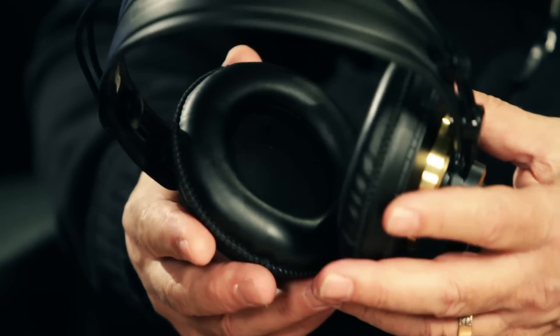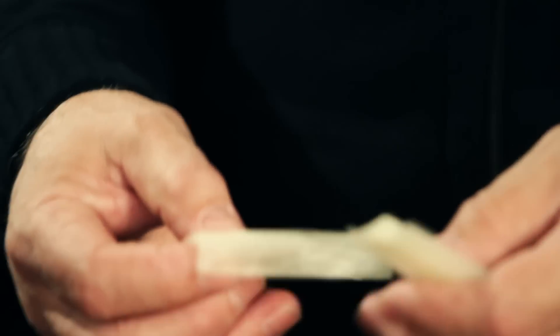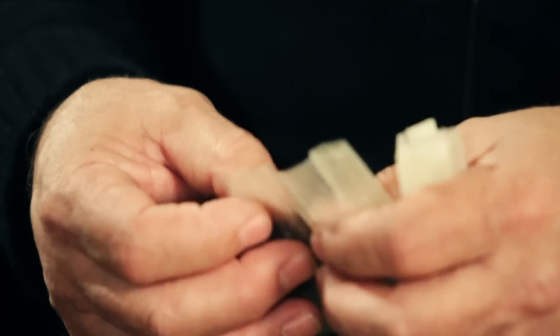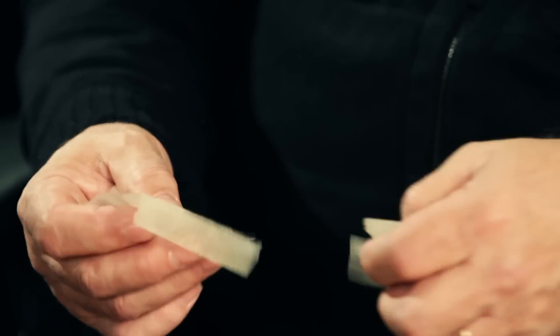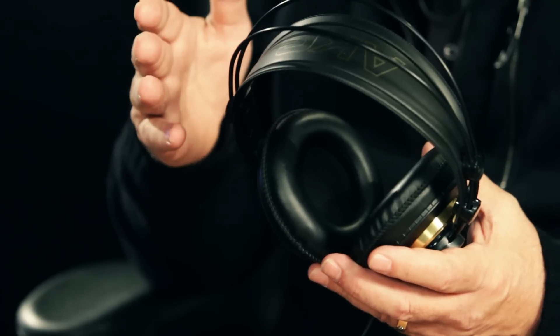And what that brings to us is clearer highs and deeper bass. More importantly than the physics, the comfort and the look, and these types of things, is the sound. The sound is what really matters. This uses a 33-millimeter diaphragm with a patented technology from AKG called VariMotion. We use it both in dynamic microphones and in our headphones. This is a lamination of two materials — our typical Mylar, which you can shape with heat and it holds its shape, dampened with a more rubber-like dampening material. This creates less self-noise in the diaphragm itself, so more pure sound is delivered to your ears with less distortion.